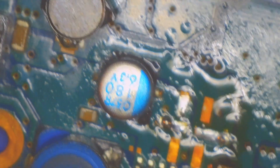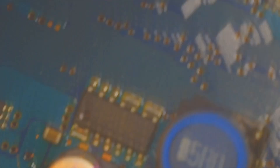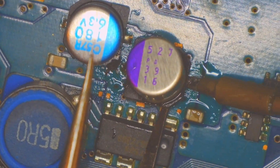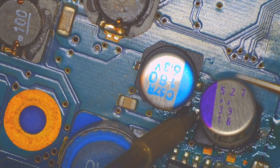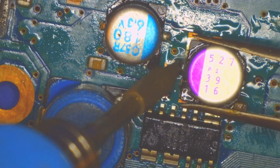The question now becomes: can I get the donor capacitor off without destroying it? For this one, I had learned a bit about how to remove it better. I came in with the same flux and leaded solder to lower the temperature, then used a soldering station and a pair of tweezers to gently pry at the capacitor while heating it — getting a little movement, letting it separate from the board little by little. I didn't want to pry too hard and risk pulling the legs from the capacitor. Eventually it came free in perfect working order. Reattaching it was just a simple matter of re-soldering it back in place. The short was gone, but unfortunately our problem still remained.